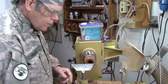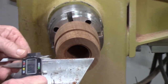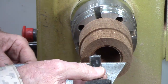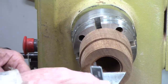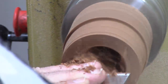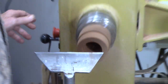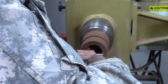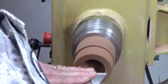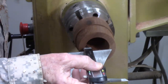Now I can go down 27 millimeters and create a little ledge on the inside that the mesh is going to go in. Zero these out, lock it so it won't slip on me. Get a rough idea where I'm going with this thing. And I'm just going to take that and continue it down, so I've got a little ways to go. Another 3/8 of an inch or so. A little more cautious slipping in to hit that ledge. I think that'll almost have us there.